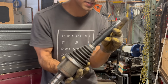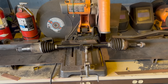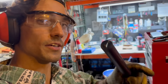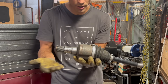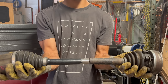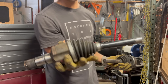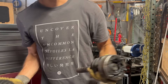Right here we have half of a Tesla CV. I bought these complete — about $100 each, which is a bummer because I was instantly cutting them in half. Cutting hardened steel like on CV shafts is no joke. This side is going to go into the Tesla motor, and this side will go into the Volkswagen wheel. This right here is half of a Volkswagen CV. What I'll do is weld these two together and then get custom ones made. I'm just going to mock this up in place and see if there's any binding. This will give me better articulation — this is the newer tri-bearing CV technology.